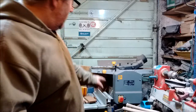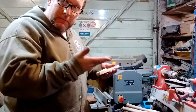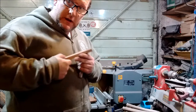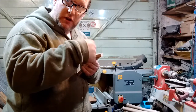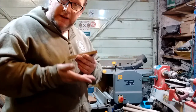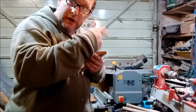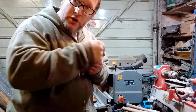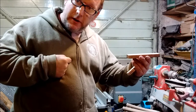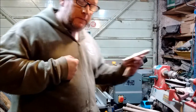Simply, it's a rotating drum with blades on it, and a lifting base that comes up from underneath as you push it in. Some driving gripper things grab hold of that and move it forward. It's stuck on the table as it's moving that way. The blade goes around, skims off the material as it goes through, and it comes out the other end.